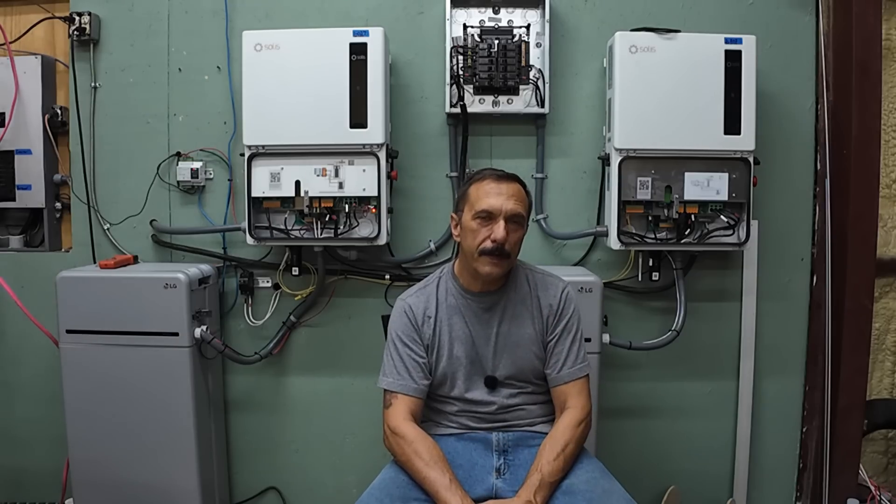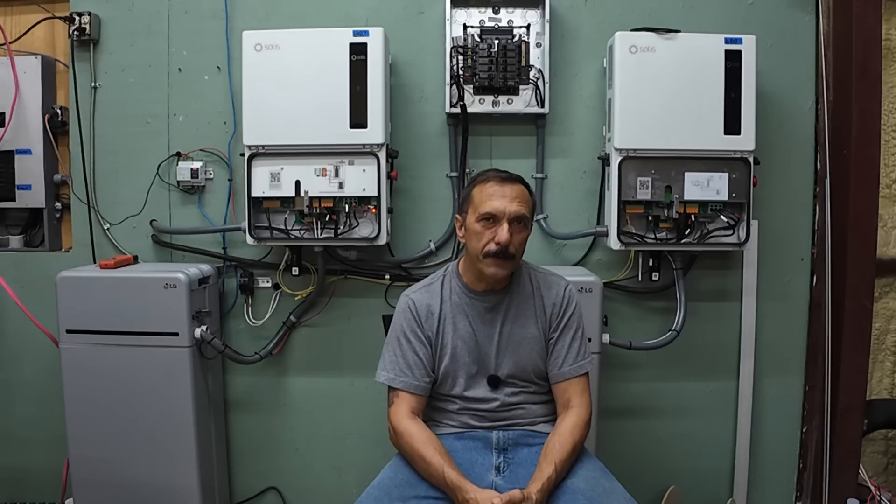I've got two Nissan Leaf 24 kilowatt hour batteries that I pulled out of some scrap Nissan Leafs I bought at Copart. I paid like $1,200 a piece for the cars and pulled the whole battery out. There's a bunch of extra components too — you can sell off the motor, the charger, the inverter, and basically end up with a free battery if you go that route. Then you take the battery and connect a little controller board to it and a few relays, a little bit of wiring, and you've got a 24 kilowatt hour battery. There's guys using 100 kilowatt Tesla batteries — just about any EV battery can be used now. I'll put a link to Dalla's GitHub site in the description so you can go check it out.